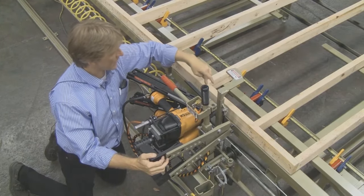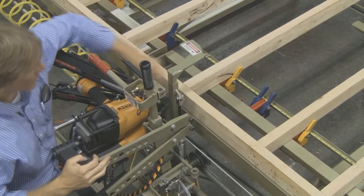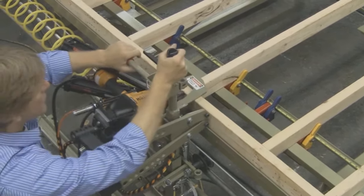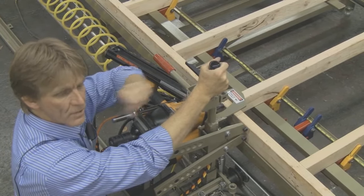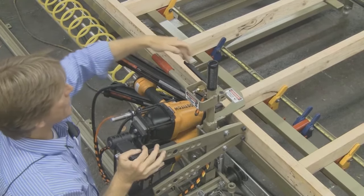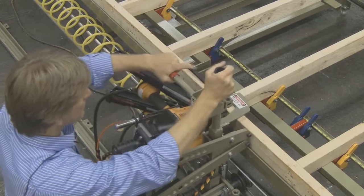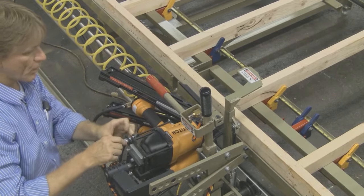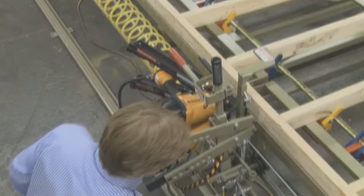Manual dollies have a down clamp pad that comes in and pushes down against the plate and the stud. You take the nose of the tool, eyeball it, and line it up against the stud. Push it all the way in — the safety's made, the down clamp comes down, and you're actually flushing the stud and the plate. You want that connection as tight as possible so when you're putting sheetrock or OSB on, you're not having waves. There's a black trigger you index with your finger and fire right off — activating each gun's trigger simultaneously and firing two 16-penny nails at one time.